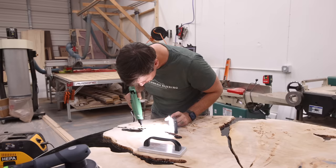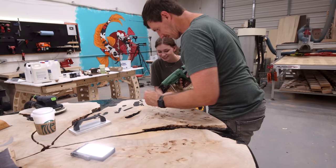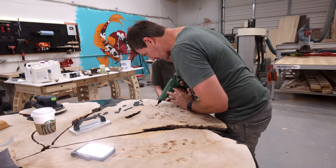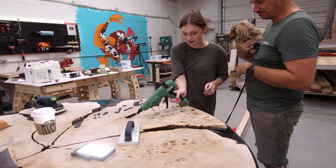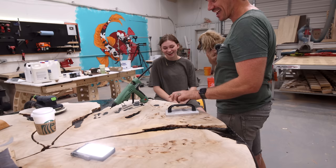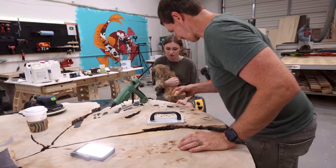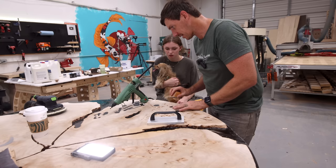This is when my daughter Chloe decided to stop by the shop and brought some Starbucks. This is essentially like a giant hot glue gun for filling knots — it's got this polymer and you just squeeze it into the hole, then press the aluminum heat sink on there. Be careful because that end is real hot. Then you take a scraper, scrape it right off, and come back with the sander to clean it up. Thanks for letting me be in your video. Anytime. The audience hates it when you're in the video.